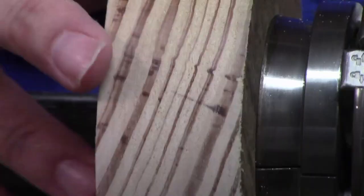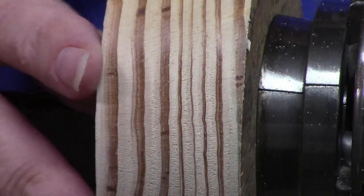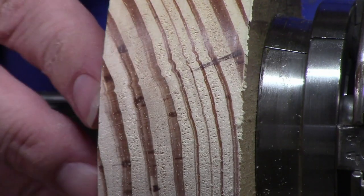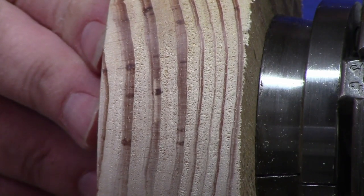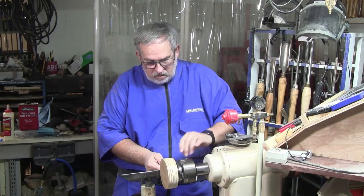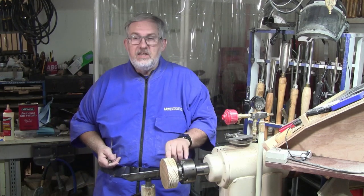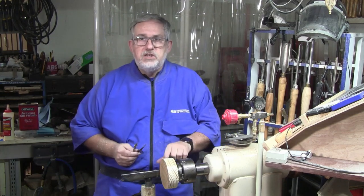I just made one cut across this. There's your end grain right there, and here's the end grain on the other side. You can see some of the little pitting, some of the little tear out — even with a freshly sharpened tool, running at about 1800 RPMs and taking my time on that cut. So we're going to make a line along this and use that as our guide. We're not going to cut past that line so we can see that original cut. Let's make a few cuts and then check it again.